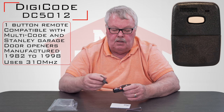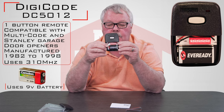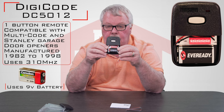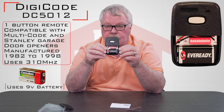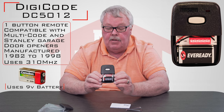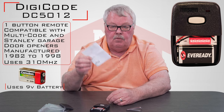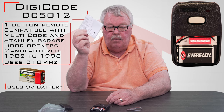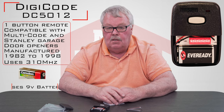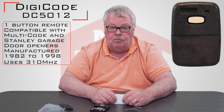This one you'll have to open up to do the training. It's got a little trap door that'll come off. You'll notice it's got a nine-volt battery in there and it's got dip switches. What you're going to need to do is find your old remote, pull the cover off of it, and you'll see that you will have dip switches. You will need to match the dip switches in the new one with the old one. Once you've accomplished that, the transmitter should work. You don't have to remember all of that because in each transmitter there's a set of instructions that come with it. My suggestion is when you get your remote, before you do anything, open the instructions, spend a few minutes and read the directions because they're going to give you a step-by-step description on how to program this remote.